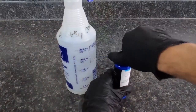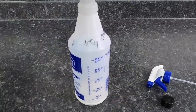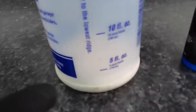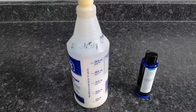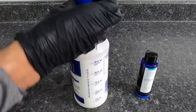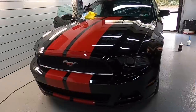This is a dilutable version of the sealant — you can get it ready to use — but all you have to do is cut this one ten to one and it will last you a long, long time. In a 32-ounce spray bottle, fill up the first quarter inch as an estimate. There is no measurement that low on a 32-ounce spray bottle, so just use that as reference. Fill the rest up with fresh, clean water up to the first line where it starts to bottleneck. Give it a good shake and head over to your project.